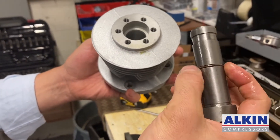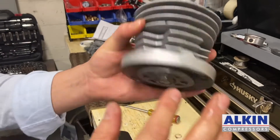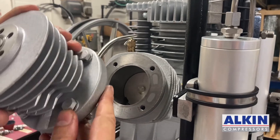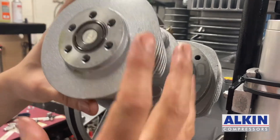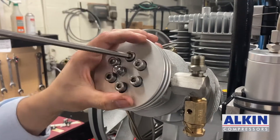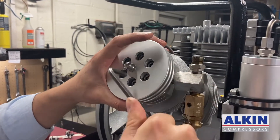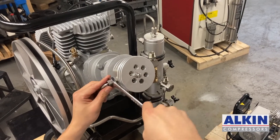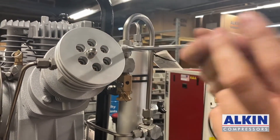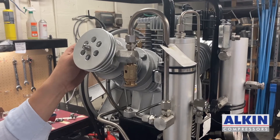You need to oil this ring right here again. Now I have inspected my rings on the piston and they are all good. I am going to install it back onto the compressor. I need to make sure this raised part will be towards the bottom. The valve is installed, pipes are installed, my rings are good — now I can start my compressor and test the results.